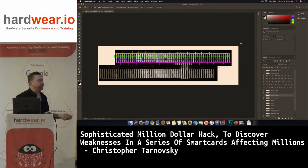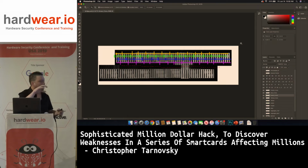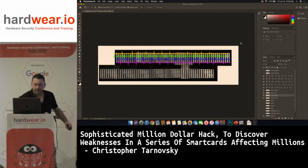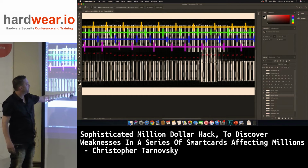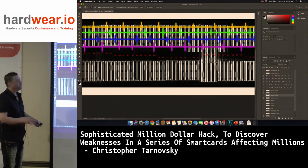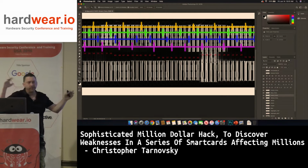So on every 66, the core moves around. It's not in the same spot ever. It's moving around unless it's the same chip, of course. And then I go to the top of the chip, and I go to the bottom of the chip and I open the shield like you can see here. Now you can't see in this picture very well, but there's connections underneath. So this wire connects to this wire and this wire connected to that wire. So it was 4 circuits. The shield was consisting of 4 different wires running across the entire chip.